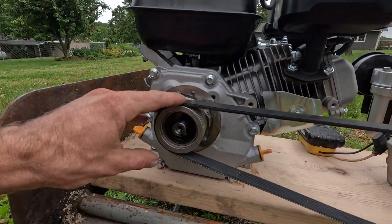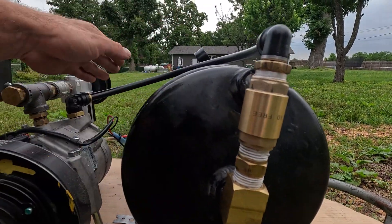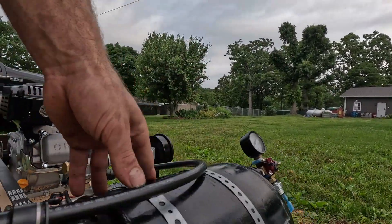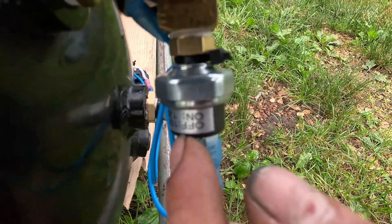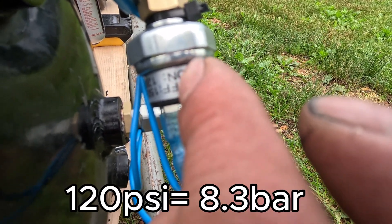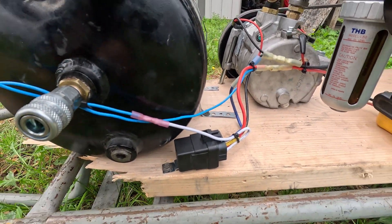In this configuration we are doing a gear reduction. We have our air tank with a drain, a check valve for the inlet pressure, an air gauge, and a pressure switch. This switch will kick the compressor off at 150 PSI and engage the compressor clutch at 120 PSI. We also have a quick couple for the air hose and a relay to do the heavy lifting.